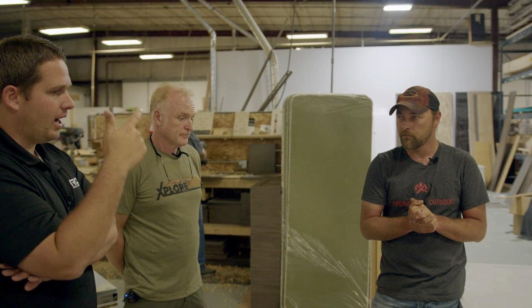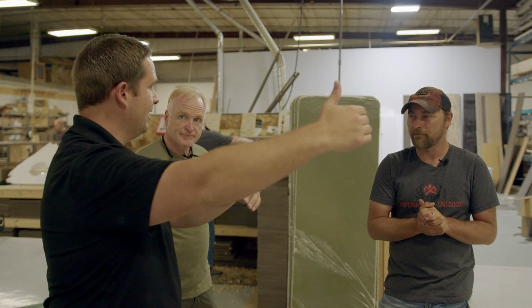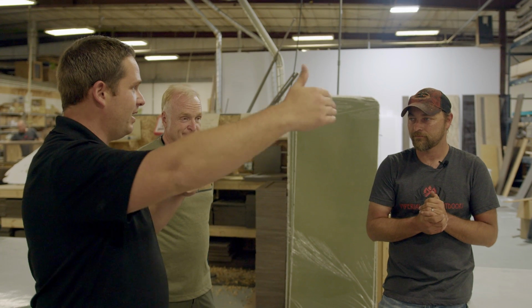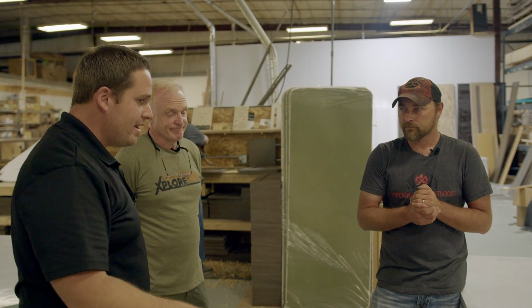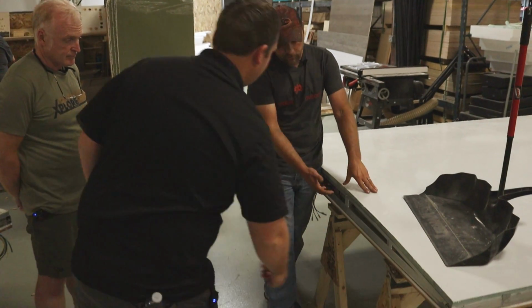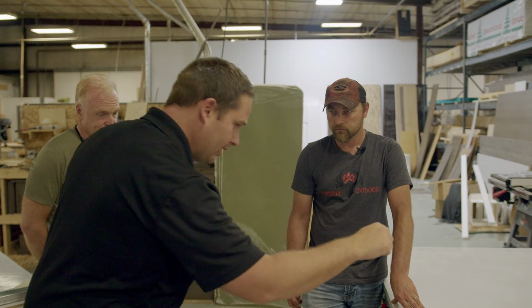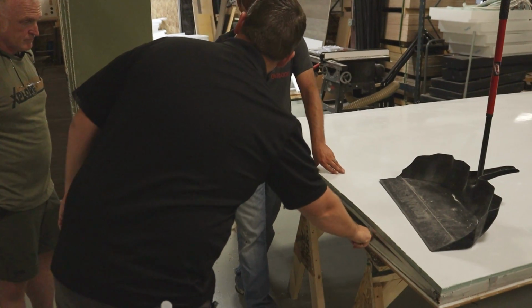Well, and that's incredible, because now as you're explaining everything, I'm thinking like plywood, you're gonna have a seam every 4 feet. Yep. Because most trailers are 8 feet. They probably use a single piece or something. And every 4 feet, you're gonna have a seam. And usually most trailers, it's just a piece of paneling right directly to the stud. You're literally, your plywood, which has almost no R value, goes through there, hits the stud, which is conductive, right, and then goes to paneling.